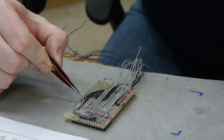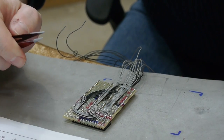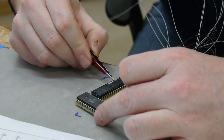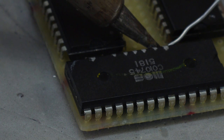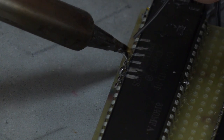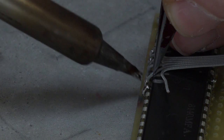This is all of the address lines going from the RAM to the CPU. I still need to attach them over to the TIA, and once I do that, we pretty much have the entire address bus wired. I think the most elegant way to attach these six address lines to the bus will be to go over at the top of the chips from here to here — that way it keeps the bottom of it fairly open. Soldering to the top of pins is something you usually only see on reworks or board fixes, but for a one-off it certainly does work here. Keep in mind that adding more solder above and below the pin can make it harder to desolder later on. The solder mass will take longer to heat back up, the suction won't be able to get at it all, and excess solder can hide places you might not be able to see.